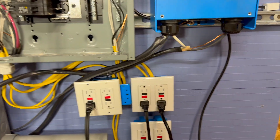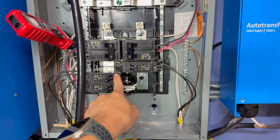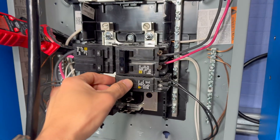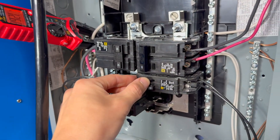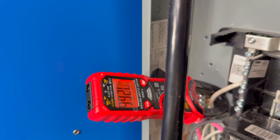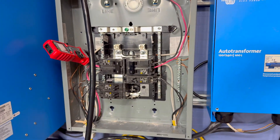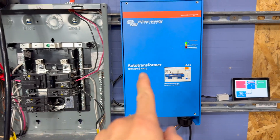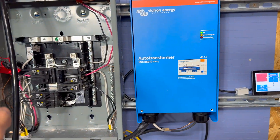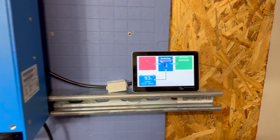Let's load it up. These two loads are on the same leg, the third is on the other leg. We turn on the electric tea kettle, and now we're reading 12.6 amps on the neutral bus - that neutral conductor is coming from the auto transformer creating the neutral to get 240 and 120-volt loads. We're now at about 6,600 watts.